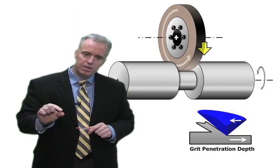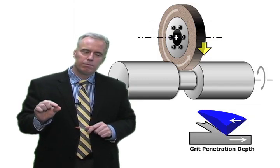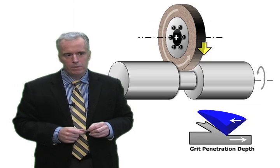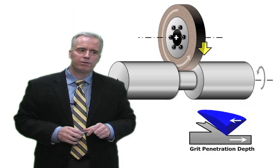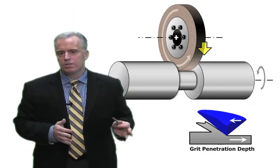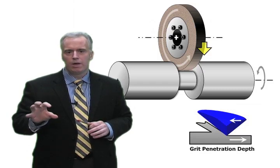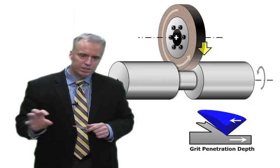What he's really saying is he's found a grit penetration depth so that each grit penetrates a certain depth — cutting reasonably well without too much rubbing. Typical grit penetration depths for a variety of operations are somewhere between 0.5 microns and maybe 1.5 microns. That's the range for the sweet spot of the wheel. If we get smaller — say 0.1 or 0.2 microns — the grits just tickle the surface.